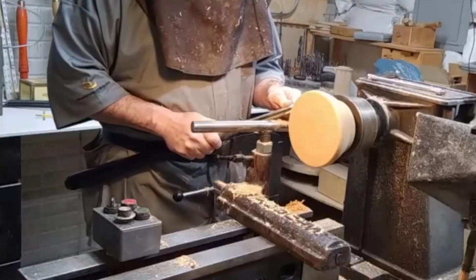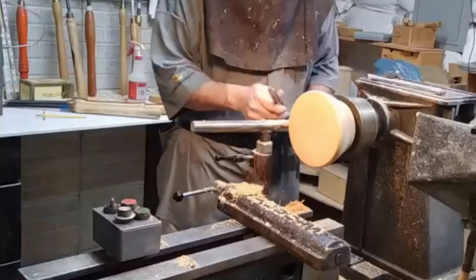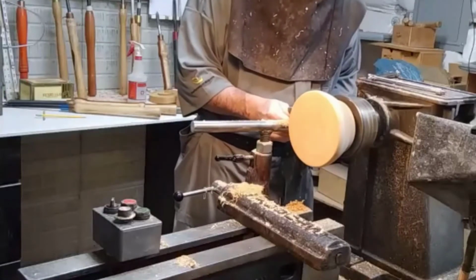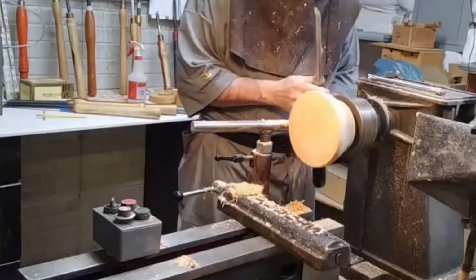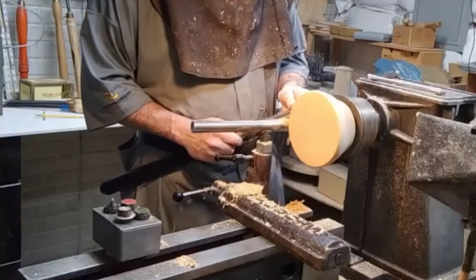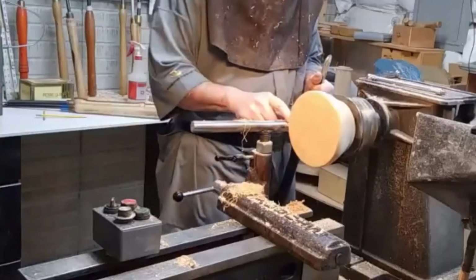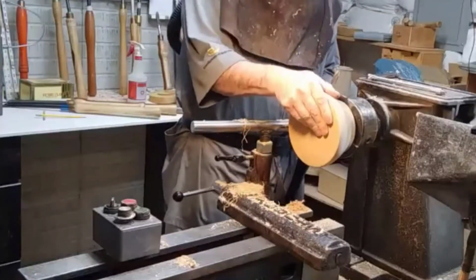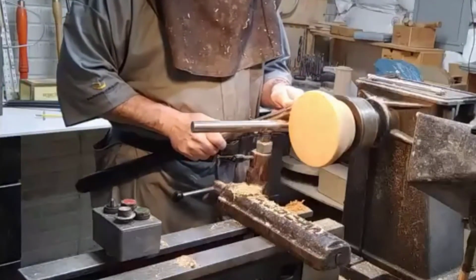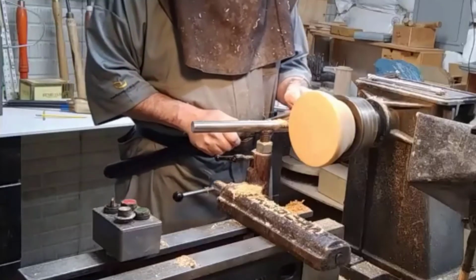Now here, I'm not going to be talking about shaping the outside so much, especially on this practice piece, but I wanted to show you a technique that I like for difficult woods. This wood is, again, dried oak, and it was not cutting that cleanly. I had better luck finishing the outside surface with the shear scrape. You can see the handle is down by the pocket of my jeans. And I squirted water on the wood to get a slightly better cut. So I was able to achieve a pretty good cut where I would probably start sanding at 150 or so,